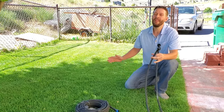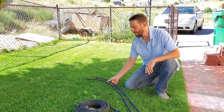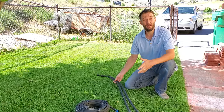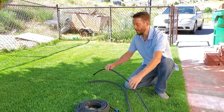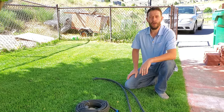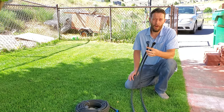It's hard to diagnose exactly the reason for everyone, but the vast majority of people who run soaker hoses — the main reason why it might not be soaking evenly across your garden bed is because of water pressure. I'm assuming that your garden bed is flat. If the hose is going up a large slope, or if there's a hump in it, that will affect the evenness of water distribution. But assuming your hose is flat, the main problem has to do with water pressure.